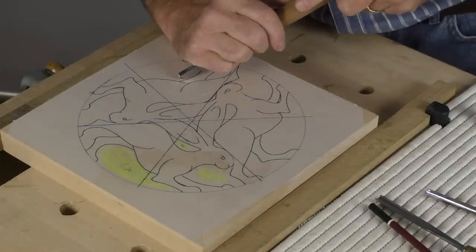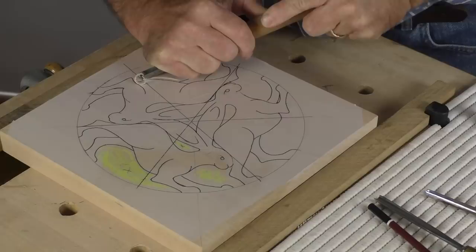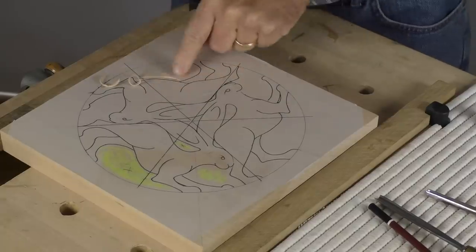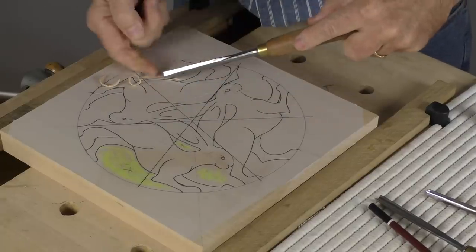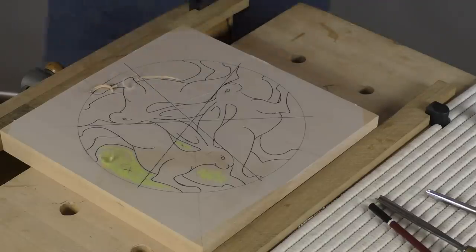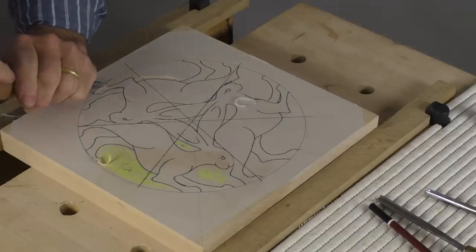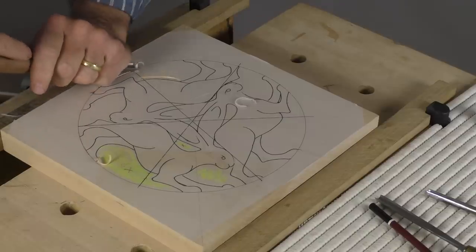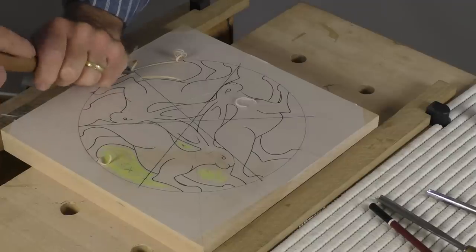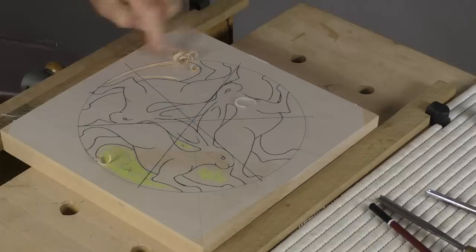Normally we would start — and we will start here — by lining in. In other words, we'll take a V-tool around the edge of these forms as best we can. As I come down I want to make sure that the good side of the V-tool, the one that's giving a smooth cut, is to the subject. On this side here, I'm coming all the way along, just inside the line, low level grip, stopping in there and making it a bit deeper. I can be a bit loose with this, but I am inside.